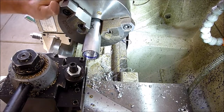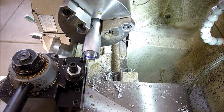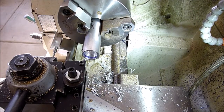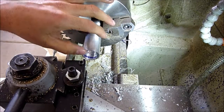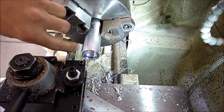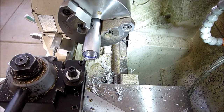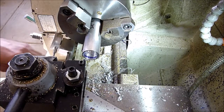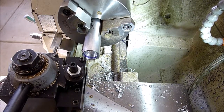So we got our speed set, we got our lead screw, and we got the transmission set to 28 threads per inch. So we can go ahead and cut these, and the double depth is 46/1000, so we're going to go about 23/1000 deep on the compound to get our threads. Kind of a rule of thumb, an approximation, is when you can't see the layout fluid anymore, so you've cut down until the peaks of the threads are maybe just stained with layout fluid, or just gone, is about right. So we'll go ahead and thread this.